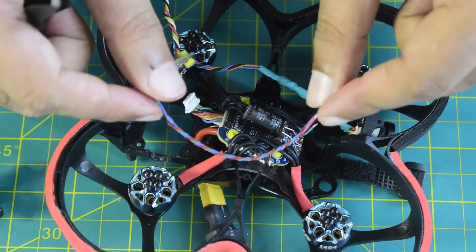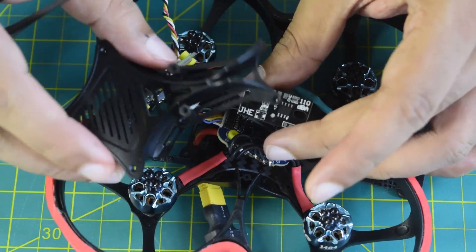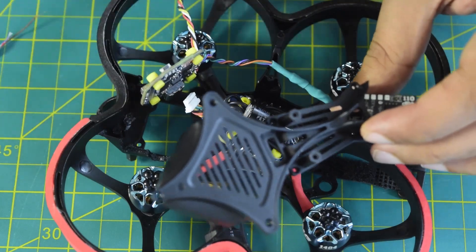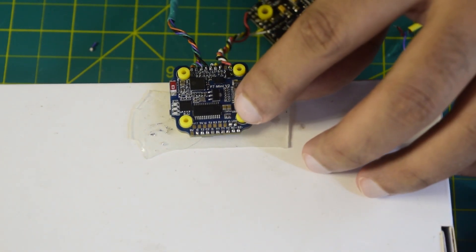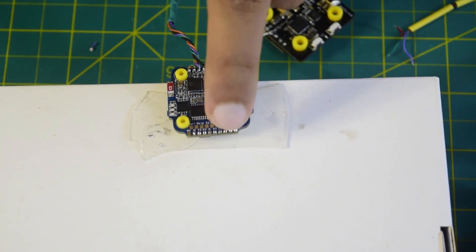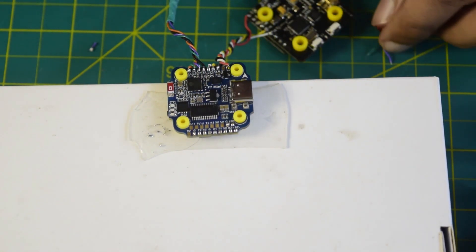So that's the wire I'm going to use. That's the high-level overview of how I'm going to connect it to my drone frame and to the flight controller. Now let's quickly solder the components and assemble it onto the drone frame. I have already tinned the ports — here you have ground, then LED, and on the front you have buzzer plus and buzzer minus.